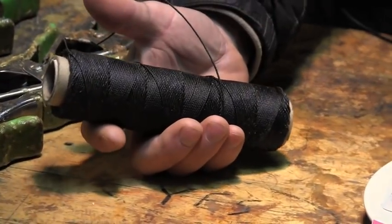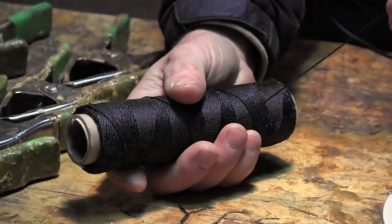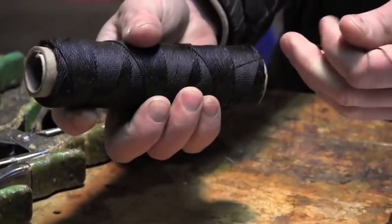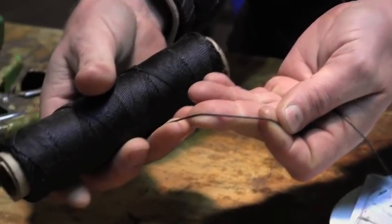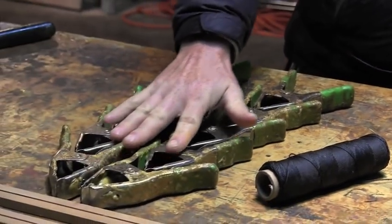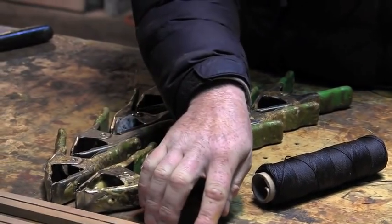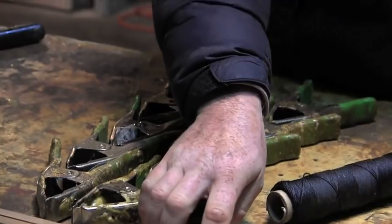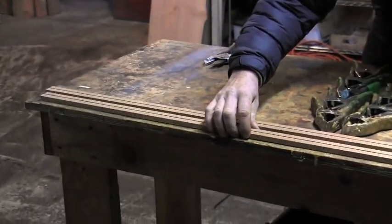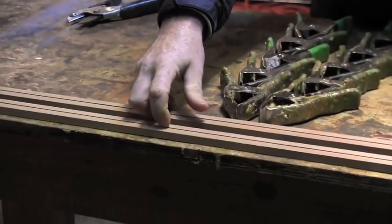This is number nine tarred seine twine, made for repairing fishing nets. You don't absolutely need tarred seine twine — you just need a string that's strong and about that big in diameter. Finally, I've got ten spring clamps for holding down a guide batten onto the top of the boat while we're cutting the new skin. The guide battens themselves are one inch by half inch red cedar — you can use whatever you want — with a little groove cut down the middle.